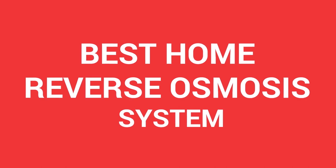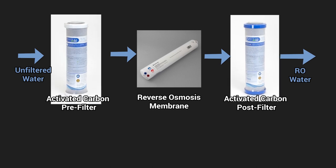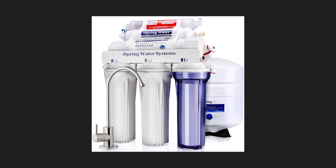What is the best reverse osmosis system for the home? Keep it simple. The best RO system will include at a minimum three filtration stages: a reverse osmosis membrane and activated carbon pre- and post-filters. In the market, you'll find RO systems with anywhere from two to seven filtration stages. More doesn't necessarily mean better — it does mean more money, more time, more space, and more complicated maintenance. In most cases, reverse osmosis is better for you than drinking unknown pollutants in tap water. However, before going all out on the most complex RO system, check your local water treatment plant's Consumer Confidence Report (CCR) to determine your water quality, and then move forward with buying what you need.